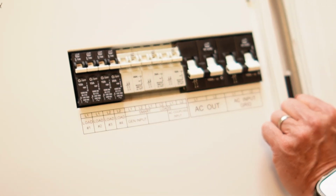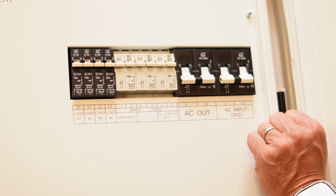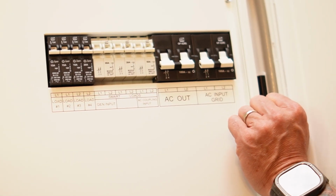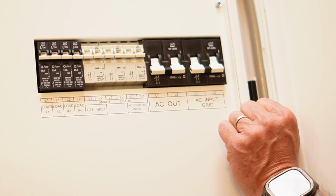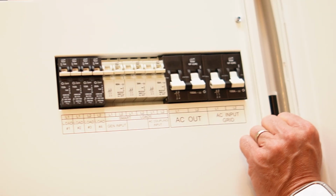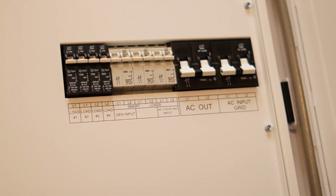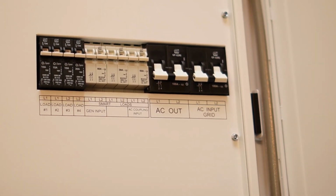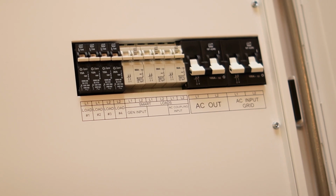There's a lot of familiar things in here for me. These are MidNite breakers. This is super cool that they have all of these integrated, like built in. A ton of these all-in-one inverters don't have any integrated breakers. You talk about having to go to the hardware store and get a bunch of extra parts. You have to buy all those DC breakers, man. Ooh, and because these aren't regular AC breakers for your load panel at your home. These are directional DC breakers that are 10 times the cost.